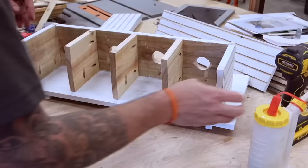Now glue and install our two gable ends. It's time to install our middle board W, which will overhang and cover part of the boxes — I'm using glue and brad nails for this. Now we need to install our front posts. You can either distress them to match the rest, or leave them natural to match the roof. We're going to line them up with the center board. The center board is inset a bit from our gables because if we lined it up with the edge, the corner of the center board would be above the roof. Then we'll install our middle board and cut our center gable, which will hold extra support for the roof, done the same way as the outer gables.